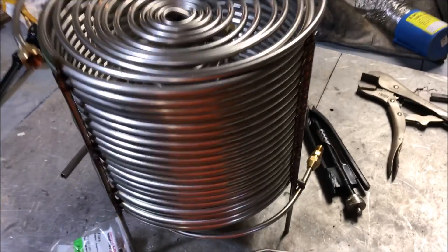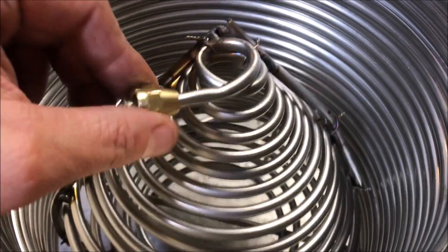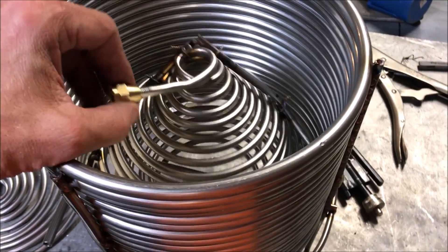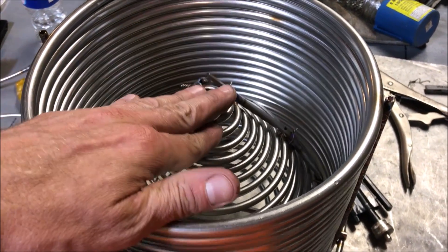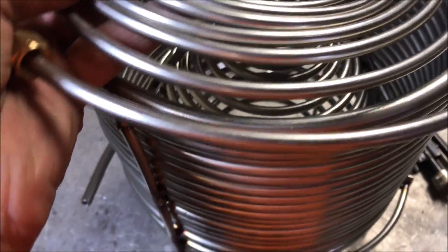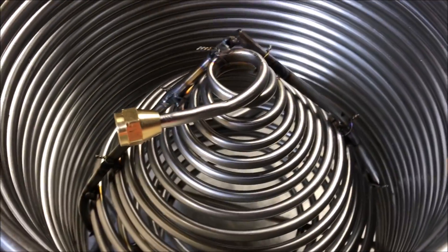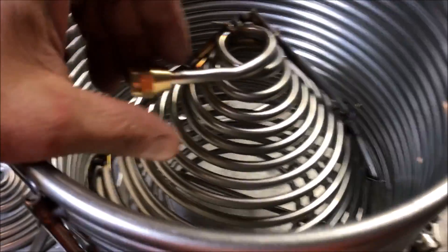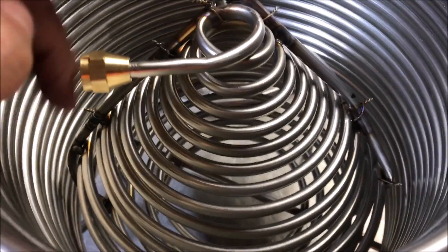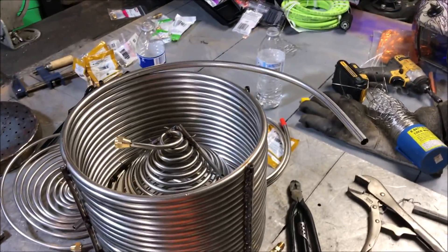Here we are hours and hours later. Like an idiot I mounted this coil — this is one of the phases in construction where you're able to streamline manufacturing. Next time I do this, I know not to mount this coil until I have assembled this section of the boiler. I wanted to braze my compression fittings — compression fittings sometimes leak after assembly, and I'd hate to get the thing all thrown together and then find out I needed to tighten it a little more. I'd rather just braze it together and be done with it.